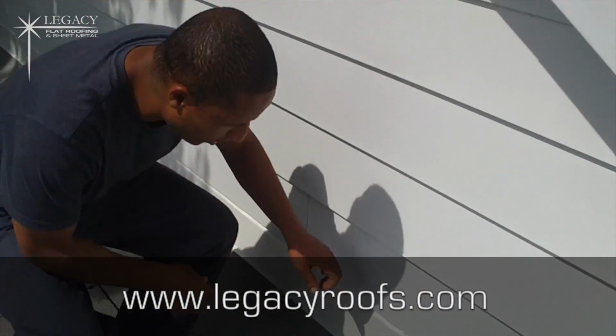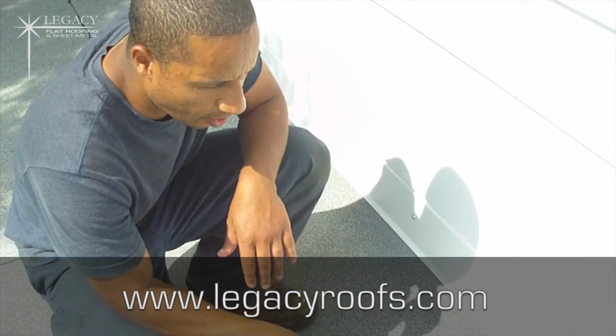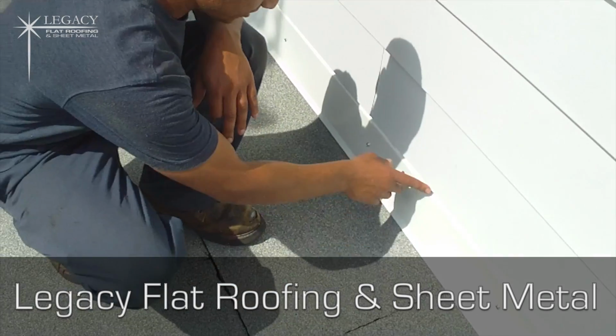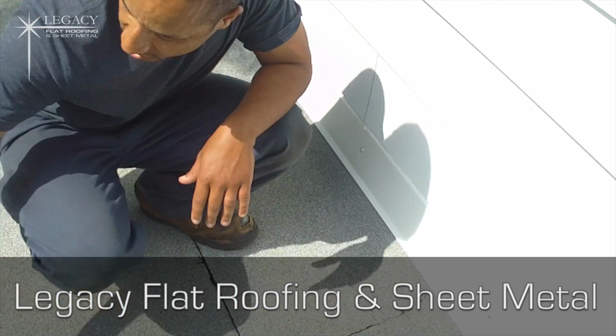So instead of lifting off the siding, because you never know what you're going to get into behind the substrate, we left the siding on. We brought the roofing up the steel cant behind that and tied it in with some drip flashing. So I think it turned out great. We have a nice water tie in there, and the water will shed down. Now we have water shedding down.